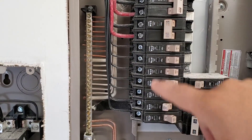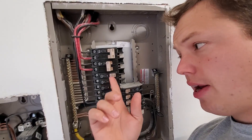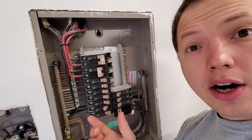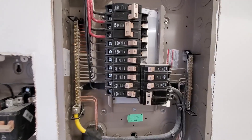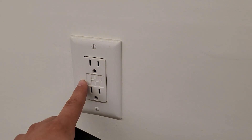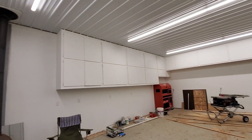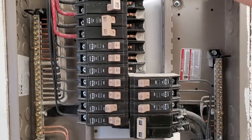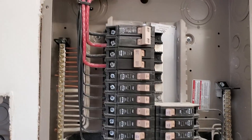Since this is not a dwelling and nobody's going to be sleeping in here, none of these breakers have an arc fault component. If these were arc fault breakers, they would be bigger and they would have a test button on them. There is still ground fault protection, though. They're using just a regular GFCI receptacle for that ground fault protection, to protect the receptacles that go along what will be the workbench and such. That's pretty much it regarding these breakers — it's pretty straightforward, pretty simple, and it looks very, very nice the way it was done.